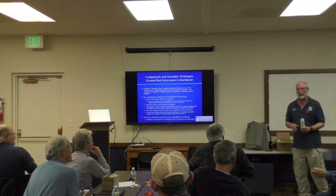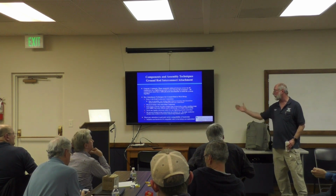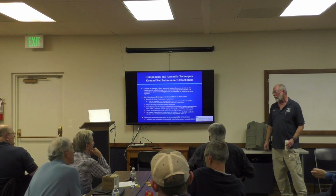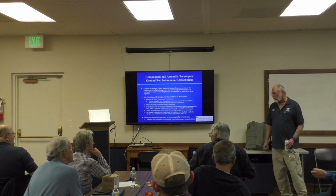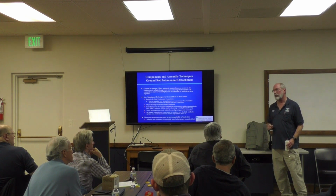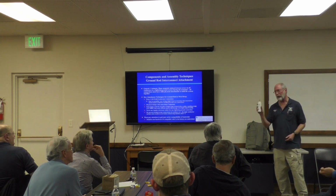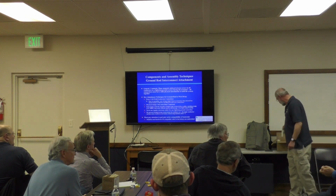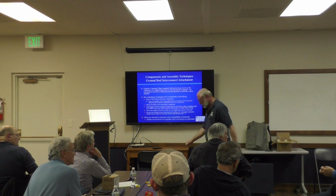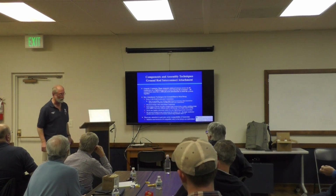At any ham station, people are often using aluminum shells for their PolyPhaser lightning arresters. So bonding aluminum, copper, and stainless steel together can all be handled by buying yourself both types of this. Copper to copper or copper to steel are not too bad. Copper to aluminum makes a battery. Yeah, and that is the effect. That current flow causes degradation.